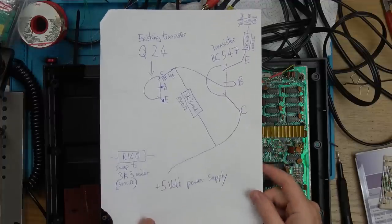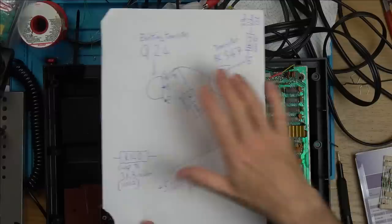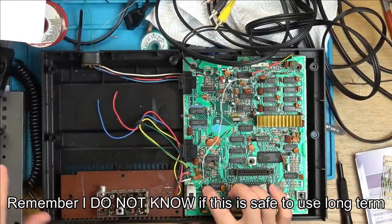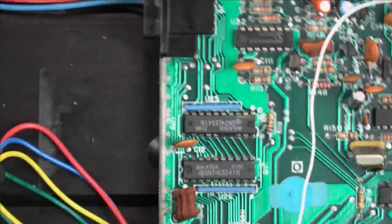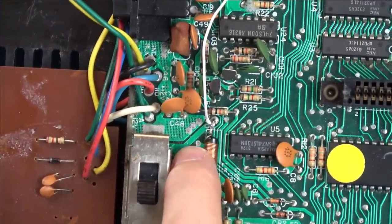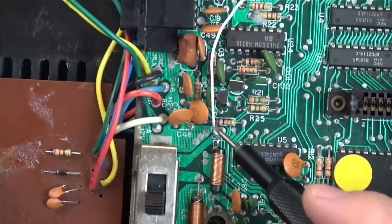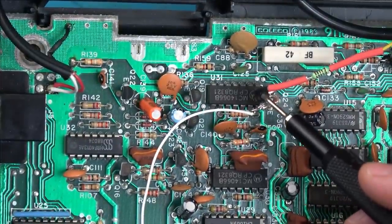So now you've seen it there, let me show you the bodge job that I've done here, and hopefully between this and this it will make sense. So let's start from the 5-volt power supply. I've taken the 5-volt power supply from here, near the switch here, this rail coming up, and you can see the top of this coil, and I've just used a bit of wire from the top of the coil, bit of wire going up here, and this is going to the new transistor